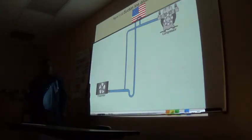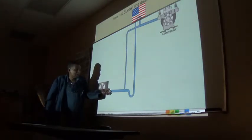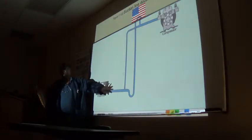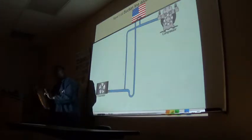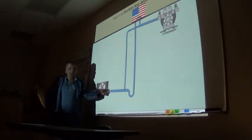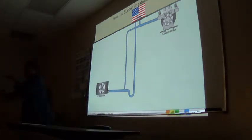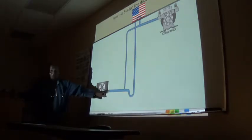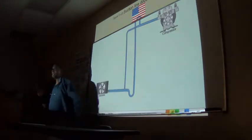Now, what we do find sometimes is that this may come up as 7/8 and that may be 3/4. It is okay in that instance to reduce right here at the exit of the evaporator coil. Reduce it down to 3/4. That's only 1/8 of an inch. But this is where I'm going to reduce it, right here. Why? Not down here or anywhere in between.